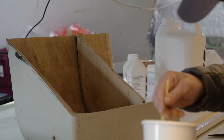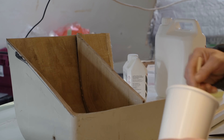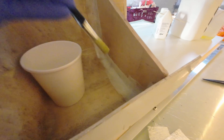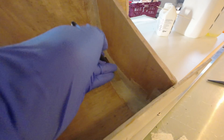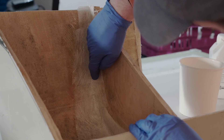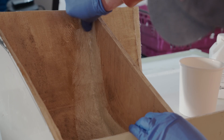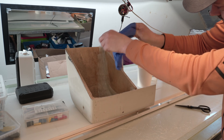Some people, usually sponsored by resin companies it seems, say that the polyester resin of the sort used in the original layout bonds just as well, but in my view neither resins are a rip off, so best to use the best option I have. The shape involves corners, and I've pre-folded the glass fibre strips to give them the best chance of not bridging and leaving air gaps. I use brushes and rollers if afraid of trapped air, but at the final moment before ditching gloves, I like to get in there with fingers to double check there's no give, and to do a final consolidation of the layers.